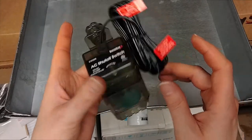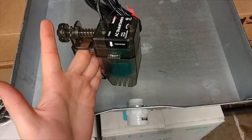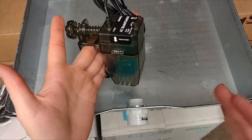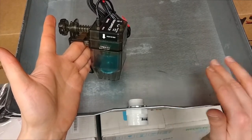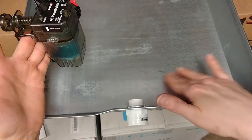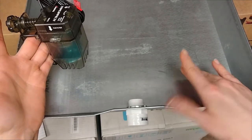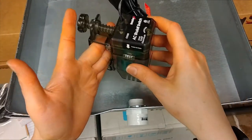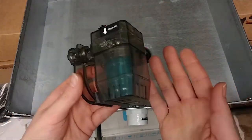A big indicator is when you come up to your unit to check — knowing it could be the float switch causing short cycling outside, or it is actually doing its job and your emergency drain pan is filling up and cutting the circuit. If you go to your unit and notice it's bone dry — no wetness, no water — because you've immediately gone up there to check, and it is indeed tripped, if you move that float up and everything kicks back on again, you know that your float switch has issues.